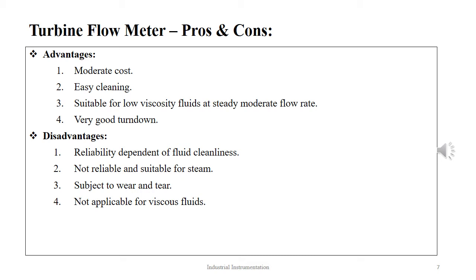But this of course does depend on the pipe diameter and the material of construction. Temperature limitations are only imposed by the limitation of the material of construction. To reduce losses or changes in the process temperature, turbine flow meters are available which can be subject to wide temperature variations. Turbine meters require a good laminar flow.